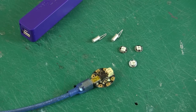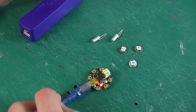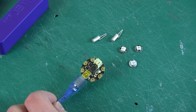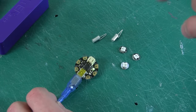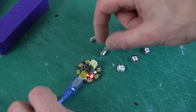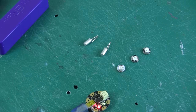So let's talk about electronics. In the head I'm going to put an Arduino — but it's a very small one from Adafruit called a Gemma, which has got three digital pins. It's being powered off one of these USB boost adapters. They're really easy to charge with USB, they manage the battery charging, and they give you a good five volts. I can swap these over if I'm doing a show during the day. So I've got a V-out on here as well which gives me five volts out, so I can power NeoPixels, which are individually addressable RGB LEDs. I can put those all in a chain on one of the digital outs and control all of the lights in the head. And I've also got some tilt switches — the non-mercury ones with the ball bearing in. So I've got three digital connections on this Arduino: I can have my NeoPixels on one, and two switches or whatever I choose on the others. So that means I can activate different lights when I tilt the head in a different direction or spin it around really fast. And that's gonna be fairly simplistic to fit — I just need to cut holes to let the light out.